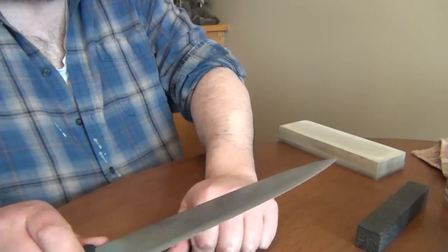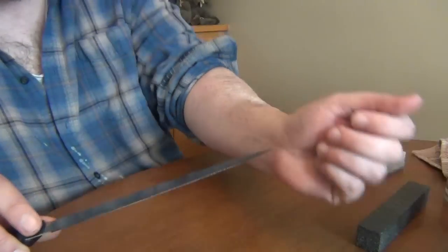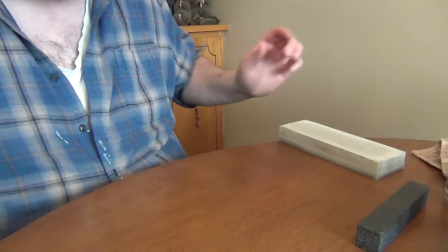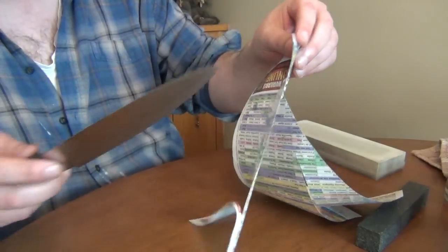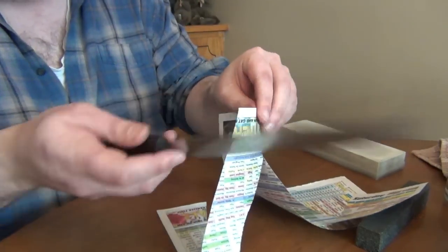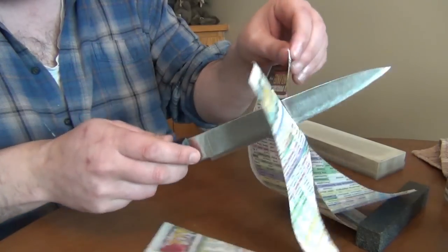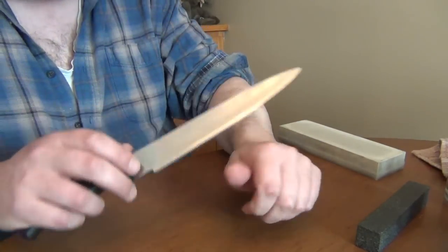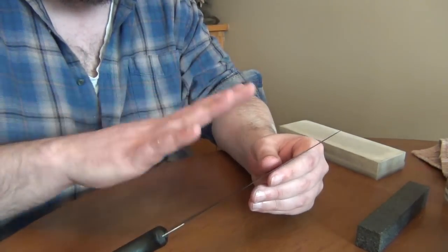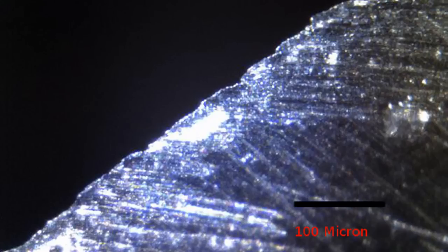This knife, as you've seen, shaves, but is a bit scratchy. Again, takes off lots of hair. Takes off skin with it. Again, that's a 36 grit edge. Easily slices newsprint, slices it readily. And we'll almost do a push cut. So an actual push cut would be at a 90. It won't really do that. But if you tilt a little, so relatively close to a push cut, it shaves, and again, it will take your hair off the same way because it's a very aggressive, very jagged, serrated type edge. That's off a 36 grit stone.